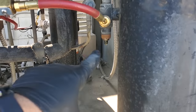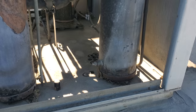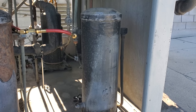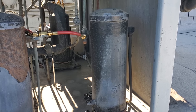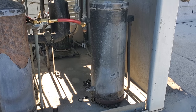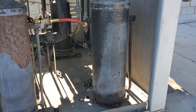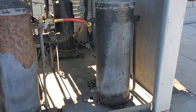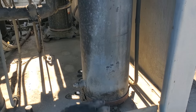Notice something too — while I'm talking to you, this is actually leaking oil because these king valves always leak. The head pressure control valve, when it floods the condenser, it needs extra refrigerant. We call that the flooded charge, or another term is the winter charge. I'm getting a little frustrated with the winter charge term because people are confusing it thinking you add extra gas in the winter — no, that's not what you do. It's the extra gas that's always sitting in the system for wintertime. In the summertime it just sits in the receiver waiting to be used. So we add the extra gas.